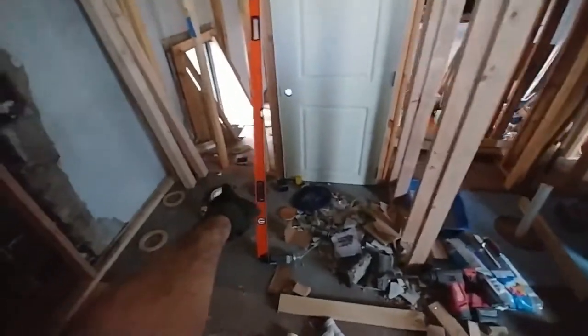We'll get that downstairs plumbing set up, and then we'll come through the floor here somewhere. And I think we're just going to stay along the floor and turn up with a 2x4 Y, and the 2-inch will get bushed down to 1.5, go around the corner and catch these two sinks. And then the stack will be complete out of here. And they'll be putting a cap or a rag in the toilet hole and the shower hole to stop the sewer stink coming in.